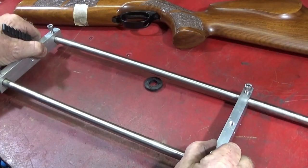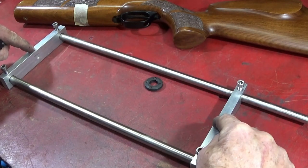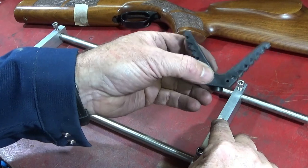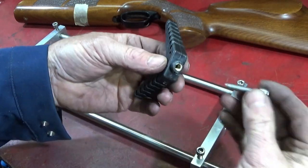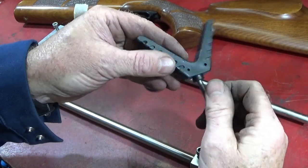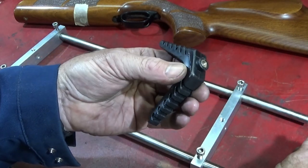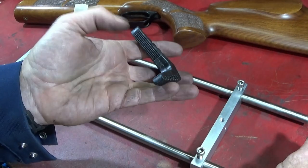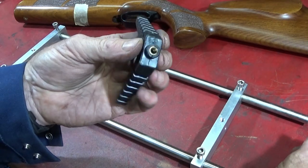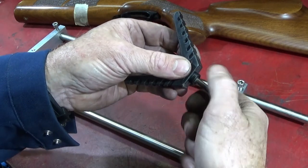So that's the adjustable base finished, and now I'm going to make the adapters for the height adjustment and the rests. While I've been doing the video, I've just realised that these are 6mm thread in these ones, which is excellent. I thought they were 1/4 UNC because they were tripod mounts, and most camera stuff has 1/4 inch UNC, but like I said, it's 6mm, so that makes it much easier to make.